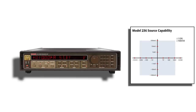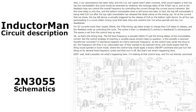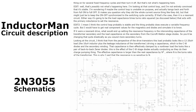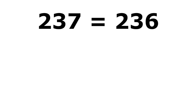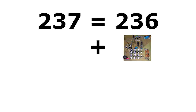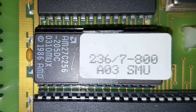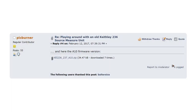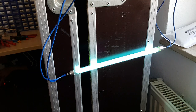Let's start from the beginning. I wanted to upgrade my Keithley 236 source measure unit into a 237 high voltage source measure unit. Thanks to EEVblog forum user 2N3055 and Reddit user inductor_man, that is now a realistic possibility. The schematics confirm the 237 and 236 are mostly equal, so the upgrade involves making a DC-to-high-voltage converter, adding a couple of transistors to the output module, cutting a jumper link, and updating the firmware.